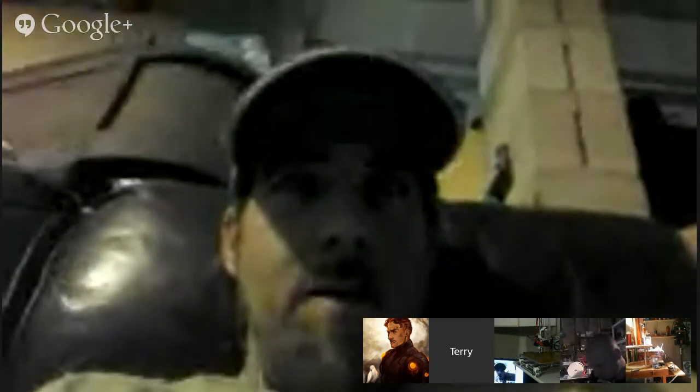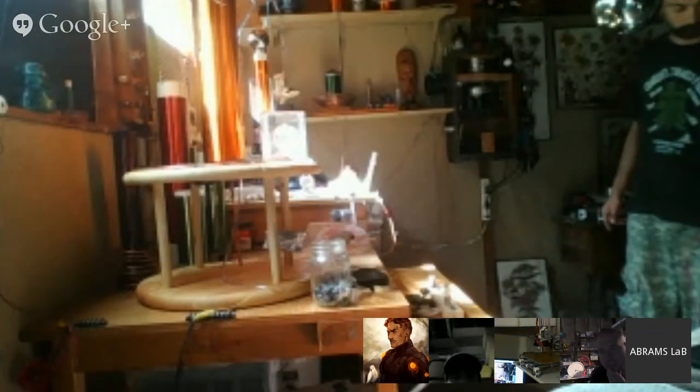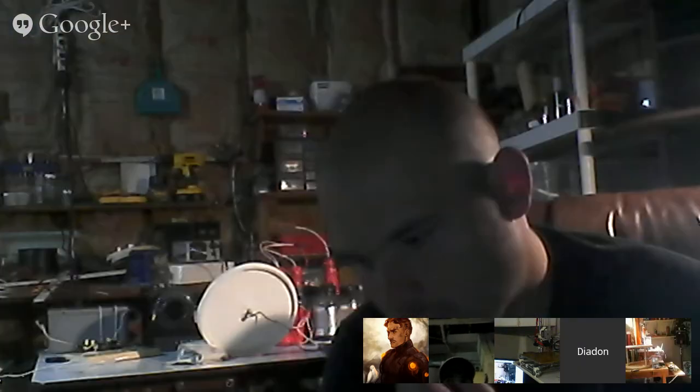The old medical type were just induction. That's what I thought. They didn't use resonance, and they had metal cores too, didn't they? Soft iron cores in a lot of cases. So it's basically just an NST, in a sense, only really high voltage, right? Yeah, and would use a low voltage, high amperage battery on the front end, and a mechanical oscillator of all different types. Usually it would be like a relay setup, or those little bouncing rods where you can adjust the spring tension. It keeps bouncing.